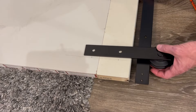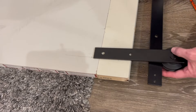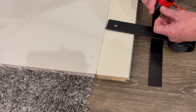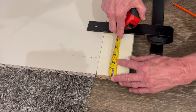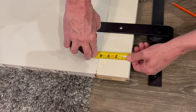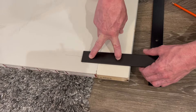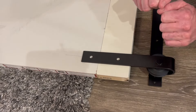Your track is going to be up here and your hangers will go on the track right here. With this particular hardware, they want this top hole to be two and a quarter inches in from the edge and one and a half inches down from the top. We mark these right here, we're going to drill these out and mount these, but not right now.